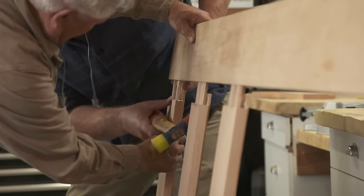All right, now we're ready to install all the filler strip that came out of the rabbet. So we're gonna lay them down roughly where they go, and we'll fit them in with each miter. Okay, so now take a long one, lay it out roughly where it's gonna go. Okay, so now we want to line it up so we have a little bit of a gap on each side here. So just like that, not much, just like that.